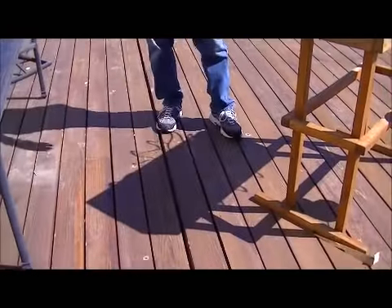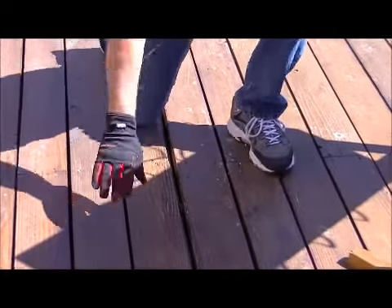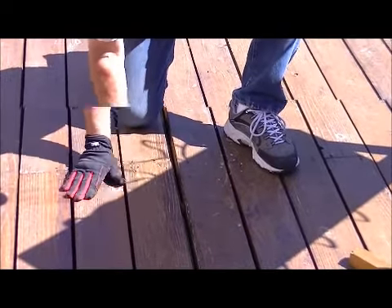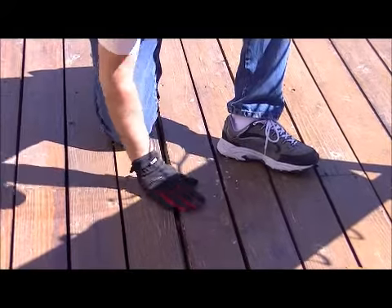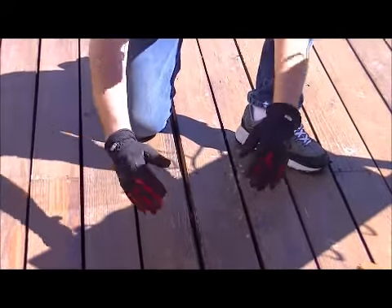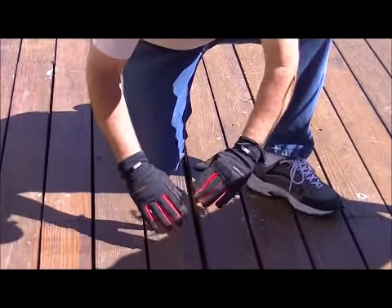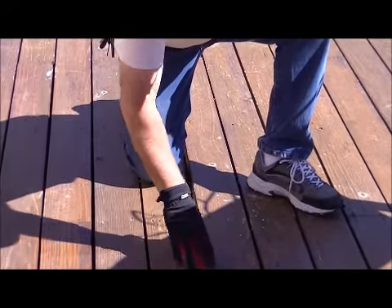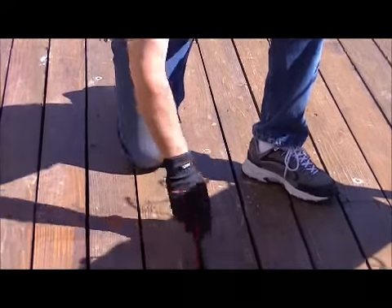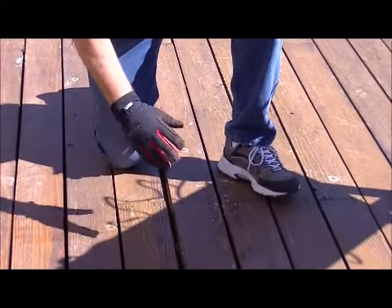As you can see, if you look down here, I'm standing on a big gap and also it's where the decking raises up and goes back down right here. There's a beam underneath here — you have joists come in — and what's happened is the joist has shrunk and the beam hasn't, and so now we're causing a pyramid which is a toe kicker and also splinters and creates problems. There's another one over there; we're going to try to fix these today.